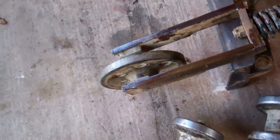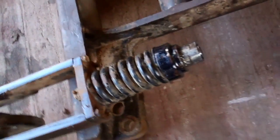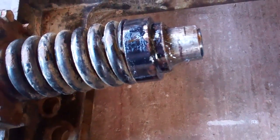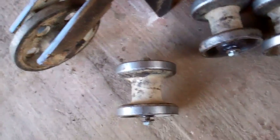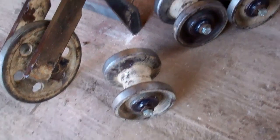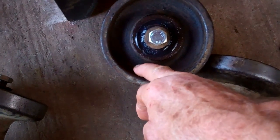Got everything cleaned up. That's the front idle wheel all cleaned up — I've also had the piston out to clean the seal, like I did on the other side, so that's all ready to be refitted. Got the three bottom rollers cleaned up and put some waterproof grease around the seals. This roller has been leaking a bit of oil.